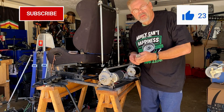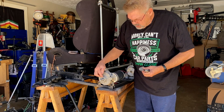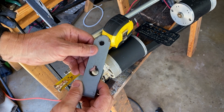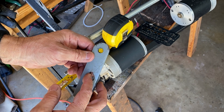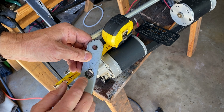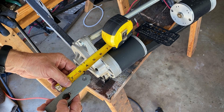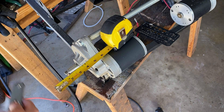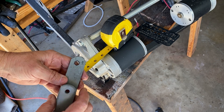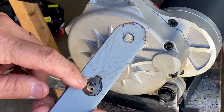We're at the point where we're going to make the lever arms. These are a little bit unique because of the keyway. I mocked this one up and put the keyway in — that takes a little while because I don't have a press, so I had to file it in there. I used a jigsaw a little bit, then filed it in and just checked it and checked it. There are two different size holes here. Let's check center to center — two and a half inches. I also started setting this one up: center to center, two and a half inches as well.